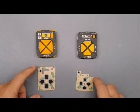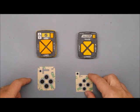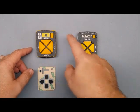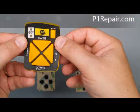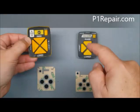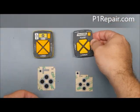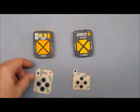This is the keypad repair kit for the Fisher fish stick plow controller version 9400. They made two versions — both have four buttons and a power button. The older version, which I call version 1, has the power and float LED on one side, while the newer version 2 has the float on/off up top and slightly different button configurations. So we have two versions of the membrane keypad repair.